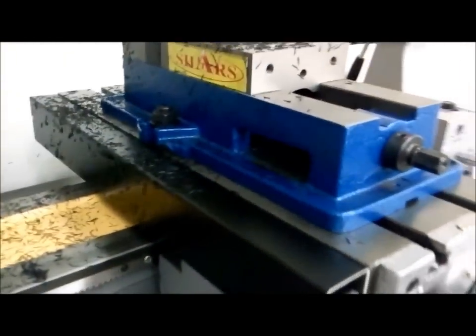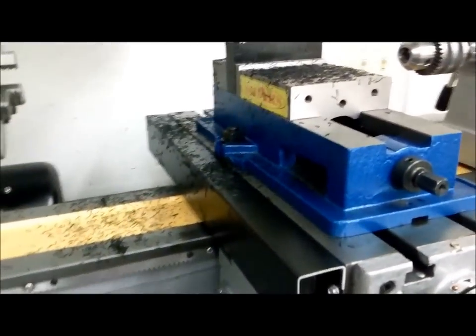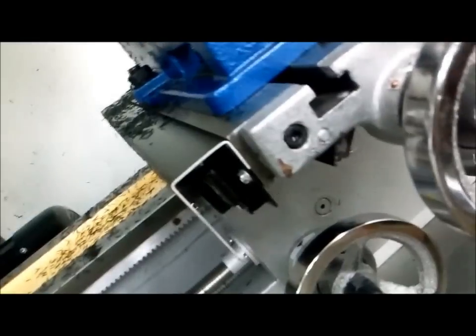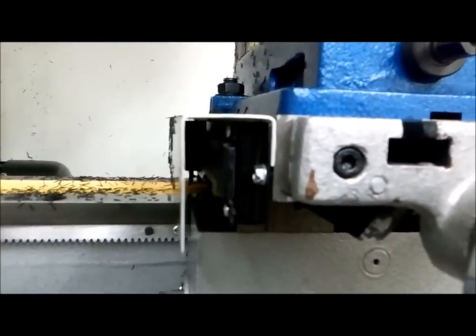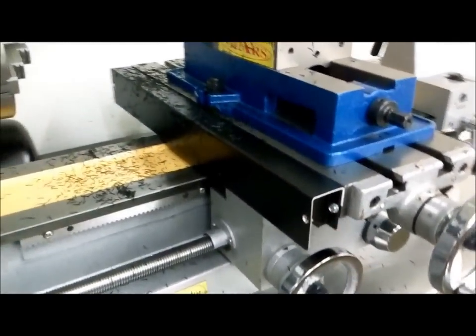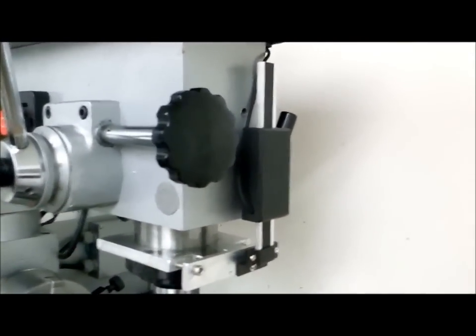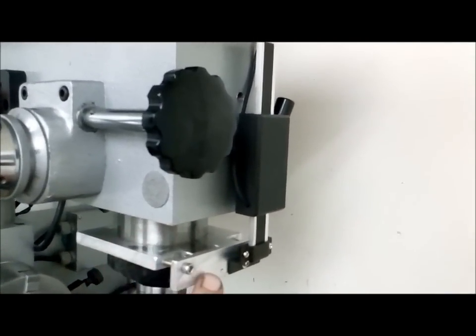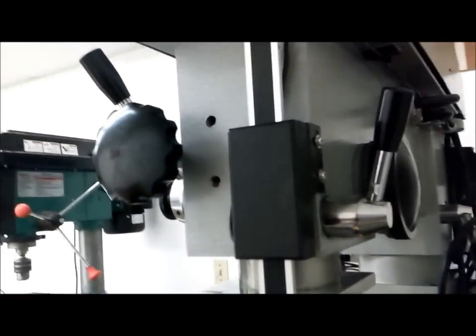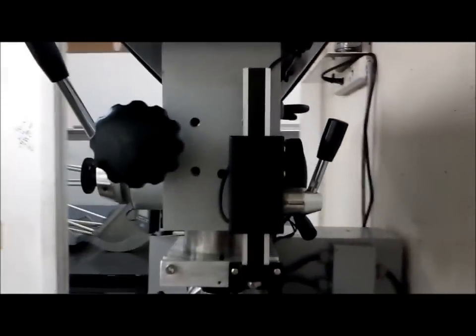This is for the other axis — that's a cover I made to keep any debris from getting in. That's probably the one you have to worry about the most. For the cross slide, I only had to drill two 10-32 holes to mount the rail. Then there's the Z axis — I made these brackets and mounted it up. I only had to drill two little holes on the side, those are 6-32. So very minimal drilling into the machine.